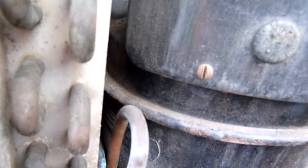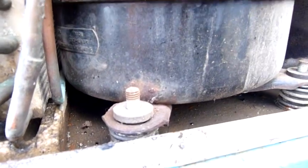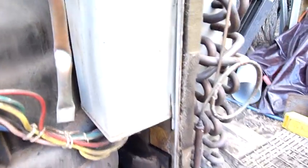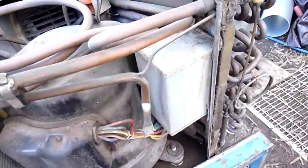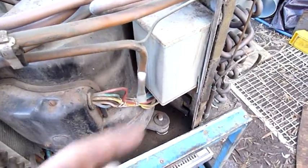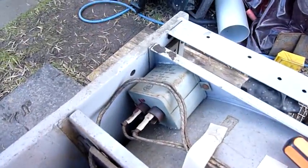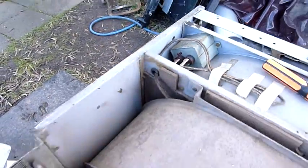It's all obscured — can't really tell what it's got rated on it. Capacitors are 30 microfarad, 415 volts, Ducon capacitor. These ones contain polychlorinated biphenyl — don't mess with them. Actually, replace them. I'm going to replace all of these if this unit's any good, same with the fan one. That's also PCB filled. Dangerous stuff. At this age, once they get hot, they usually have a habit of blowing up like my old galvanator did one day. That was pretty evil.